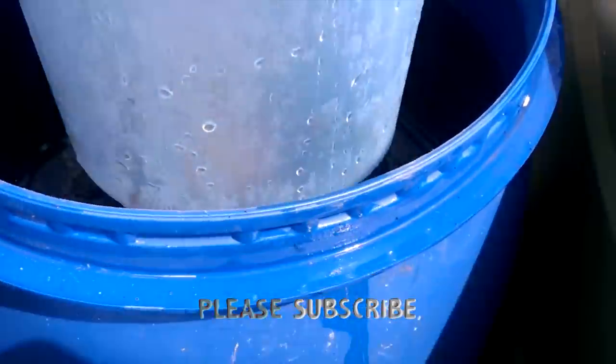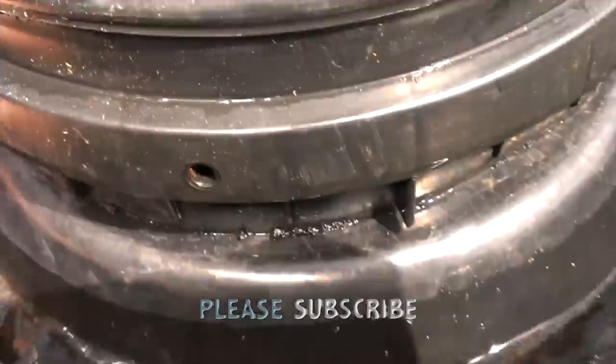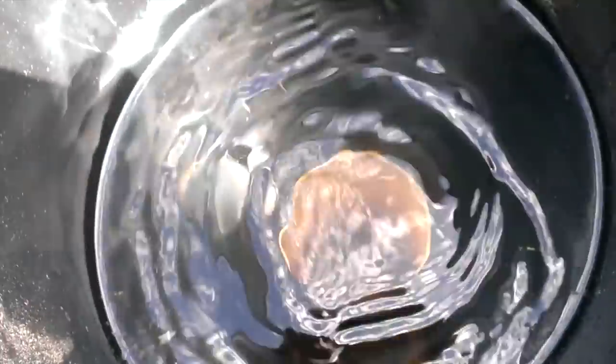So this just goes back over the center, like so. Now the water's coming up the center, has to be forced all the way to the bottom, and then once it gets to the bottom, in order to get out, it has to come back up again. So that direction change should make all the solids drop.